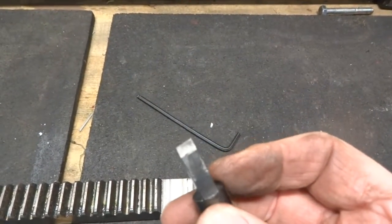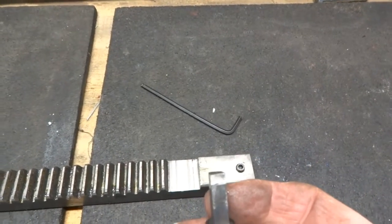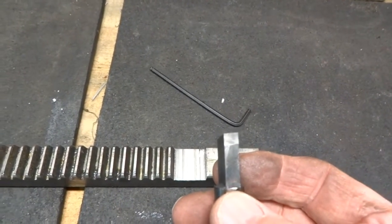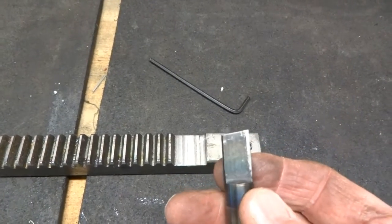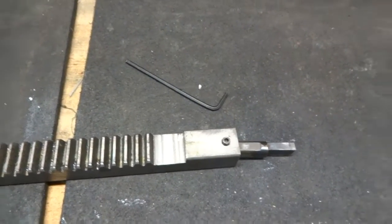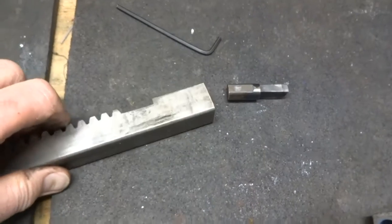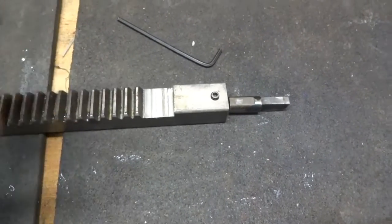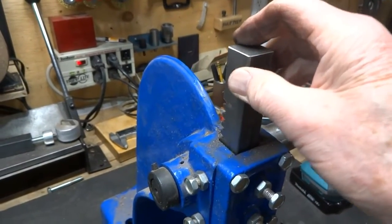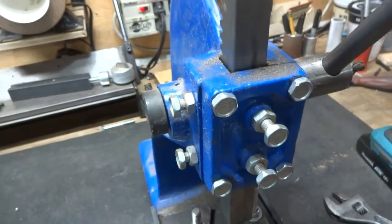This is a little bit on the big side perhaps, and unless you had a really big washer, you might want something smaller to cut your keyway. This may even work on a short length of tubing that you want a keyway inside — I've never tried that, I've just done it with washers. That was a mistake putting the set screw on this side; it should have been on the other side for better accessibility. The less slop you have in this rack — and it's adjustable with these — the better this seems to work.